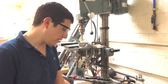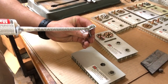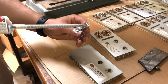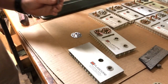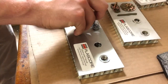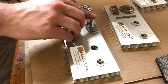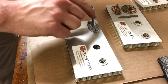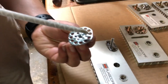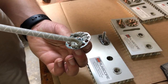Now that we have our deformed nut on, we're going to add our bonding fasteners as well. I'm just putting the adhesive directly on the back of this bonding fastener. In this example, I'm doing zero surface prep — this adhesive is designed for primerless adhesion to metal. This particular fastener is zinc coated, so I might recommend, depending on the load it's going to take, scuffing up the back to remove the coating so you're adhering to the metal and not to the coating. But for light duty bonding and my purposes here, this is fine.